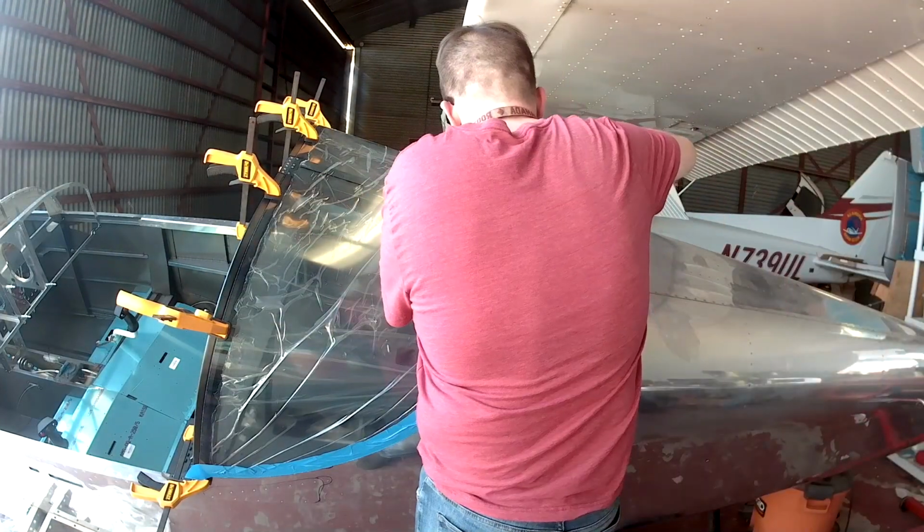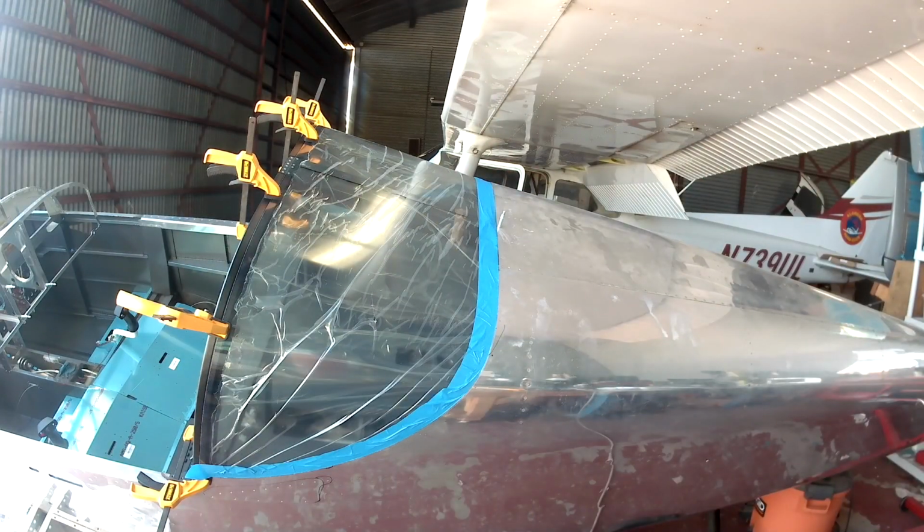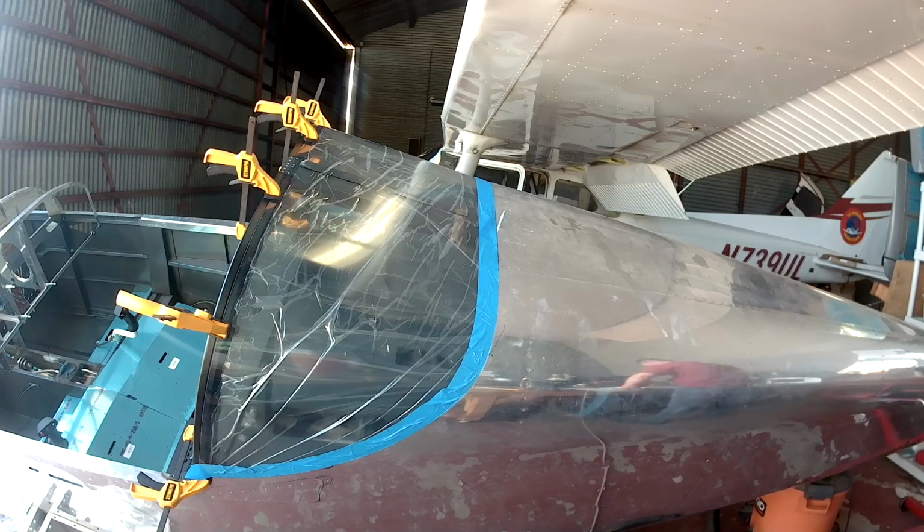You pour that over the area where you're supposed to be drilling, and I also dip the drill bit into it, because the drill bit's very small. We're drilling with number 40s. So the solution will basically hold itself in place. It's like how many drops of water can you fit on the head of a penny? A lot, right? Surface tension. The surface tension keeps it inside the grooves of the drill bit, and it makes perfectly smooth holes. There is not one hole in my acrylic that's not perfect.